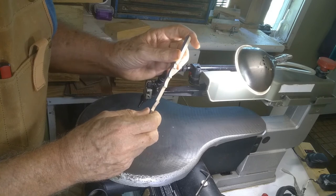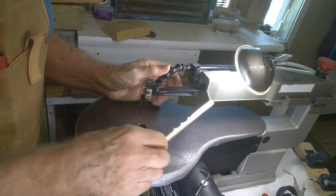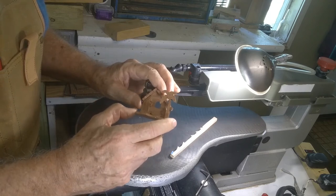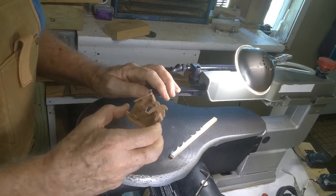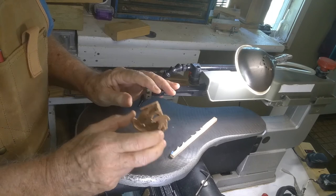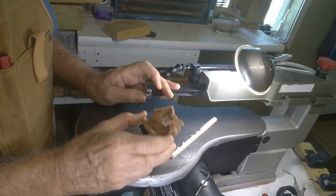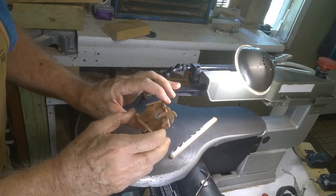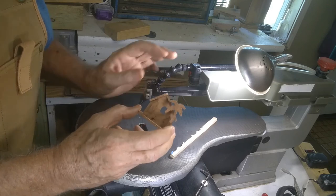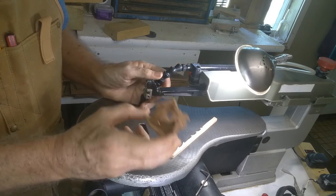As far as blade size — they run one through twelve. I use fives for over half of what I do, and a large chunk of the other half I use threes. I'll use a one if I'm getting down to very small detail cuts internally — it's much easier to control. If I get up to something larger, even in softwood, I may go to a seven or possibly a nine. But generally I stick with fives and threes. When starting out, most vendors sell packs of blades ranging from sizes three to nine or three to twelve — that's good to have. But you're going to need fives most, and it wouldn't hurt to have some threes and sevens. That will cut 90% of what you want to do.